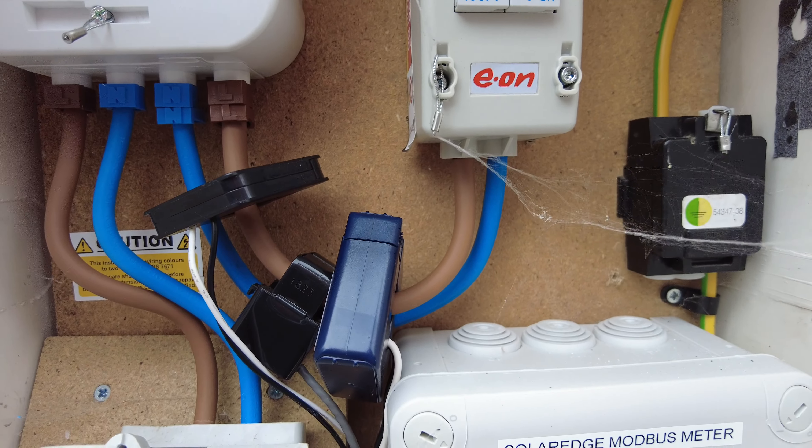Now on the main screen we can see we're generating 600 watts solar, and the house is using 600 watts with nothing going back to the grid. Things will now work correctly — any surplus solar we get will charge our Eddy or our Zappi. We also get information on the devices as well as in the app if we have the hub. That's it — hopefully you agree it's fairly easy to set up. The My Energy Harvey makes things much easier than having to run multiple CT cables, especially if you have more than one device. Just have the Harvey closer to your gubbins and do wireless communication to everything else. Like and subscribe if you haven't already — until the next video!